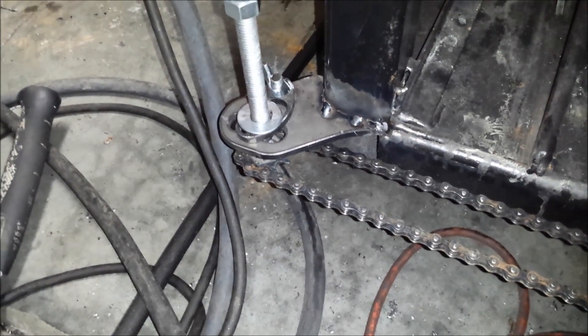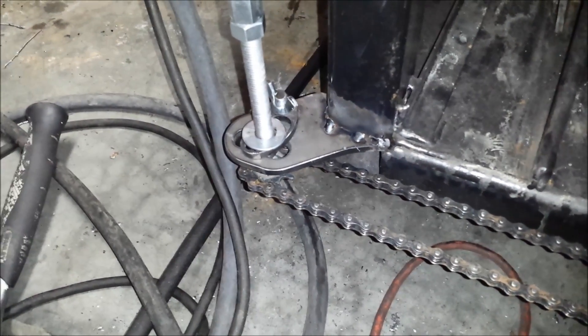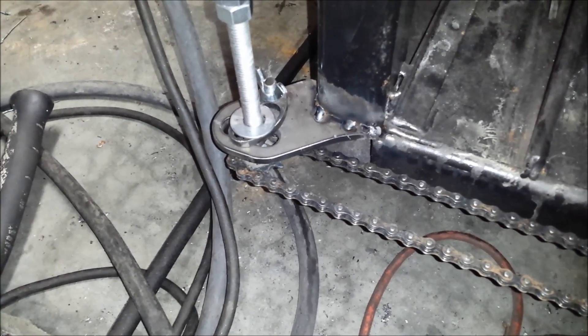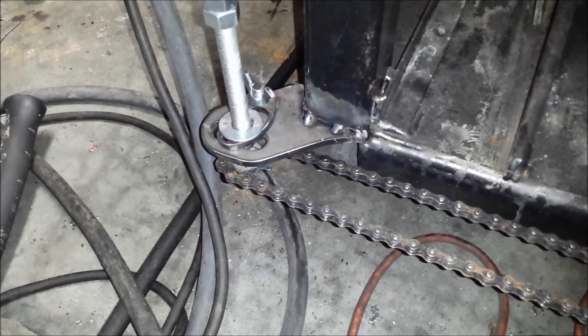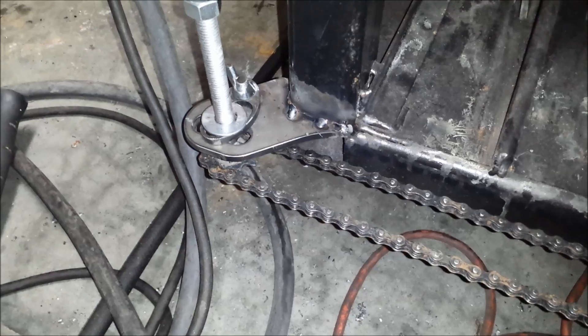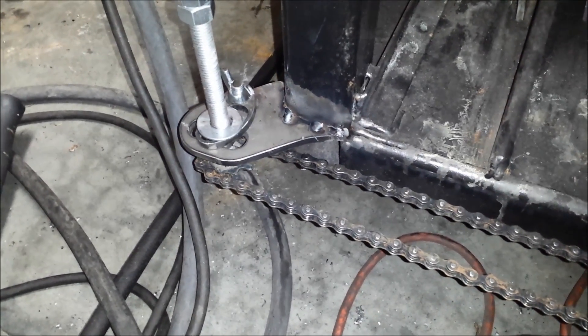I did try to raise and lower the elevator and I discovered two problems. The chains are not falling off this time — that's good. But I think my sprockets are slightly miscut, because as the chain wraps around at about 360 degrees, I'll hear just a little bit of a pop — a little chain popping either down here or over there.